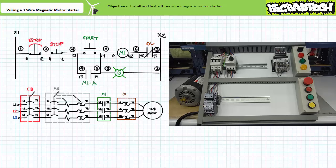When an operator presses and releases stop, the pilot light goes off, the contactor physically opens, and the motor free spins to a halt. When an operator presses and releases start again, the pilot lamp comes on, the contactor physically closes, and the motor rotates in the same direction. When an operator presses and releases the e-stop, the pilot lamp goes off, the contactor physically opens, and the motor free spins to a halt. The maintained contact e-stop prevents the system from restarting until an operator resets the e-stop into the closed position. It looks like our three-wire control circuit works as intended.